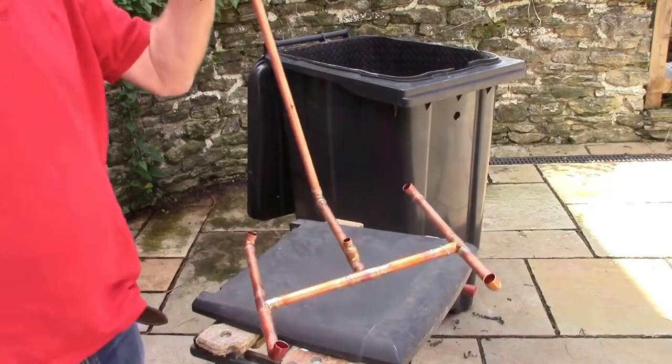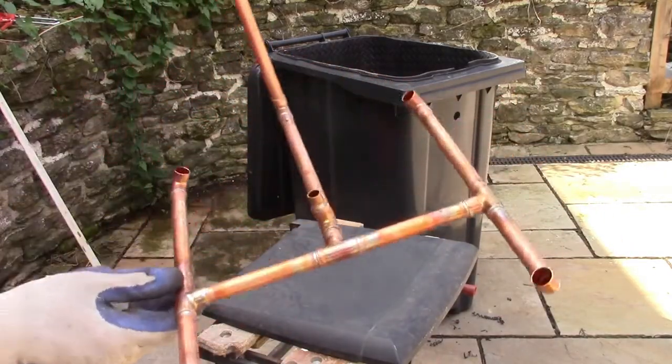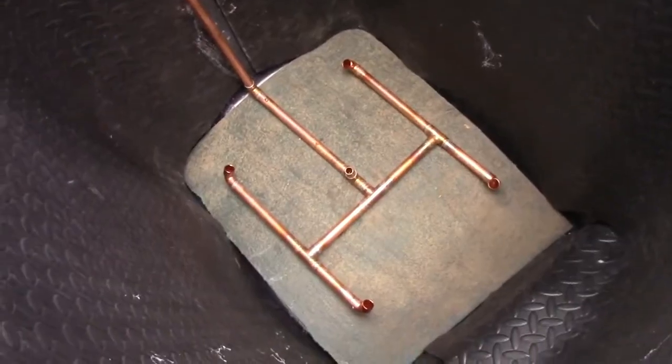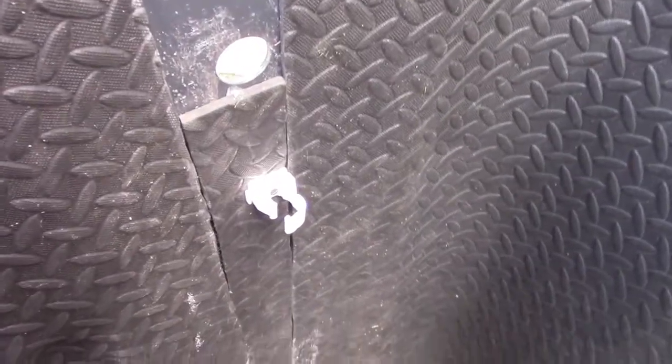Now this is the completed unit after soldering. I'm not going to demonstrate the soldering. You'll see that the corner pieces are angled inwards to direct the steam in. The central one has a 10mm reducer on it, but in truth the details of how you finish that are not crucial. That's again just checking that it's the right height. To fit the steam distributor in I'm using ordinary pipe fittings, but ones which clip shut so that they lock the pipe in place. They're fitted to the bin with penny washers and also nylock nuts.